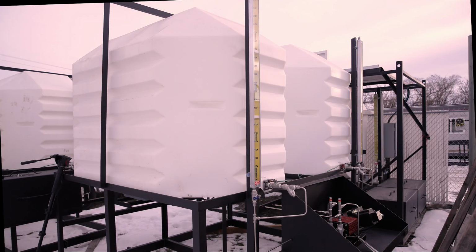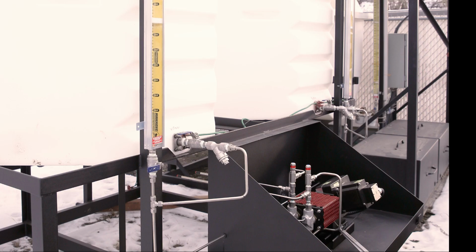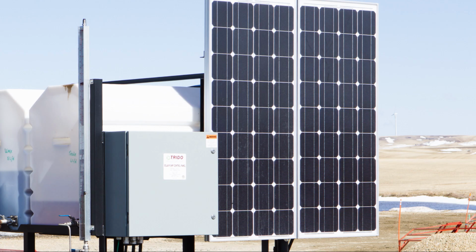The chemical tanks. If the skid comes with more than one chemical tank, mark the tanks with the chemical in each of the tanks, then follow the tubing from each tank to the chemical injection pumps. Identify which tanks are connected to the individual pumps for future reference. Also, there will be a sight glass for each pump, as this will be used for calibrating the individual pumps later.